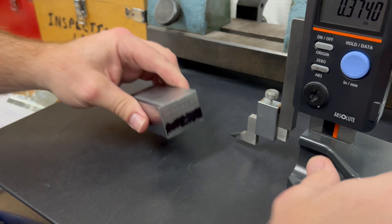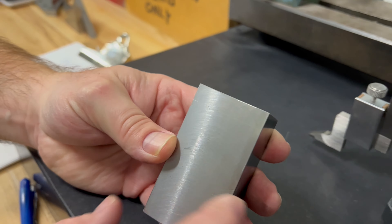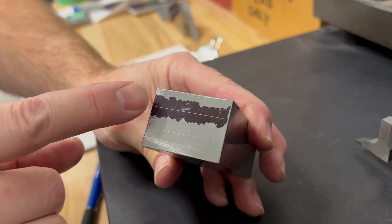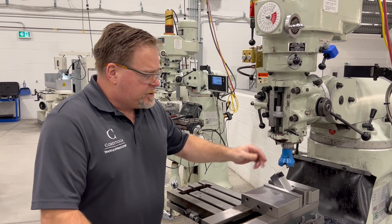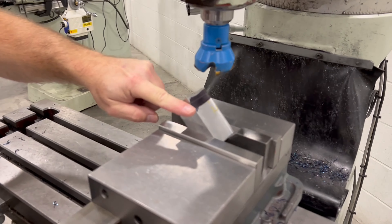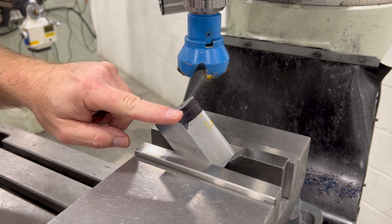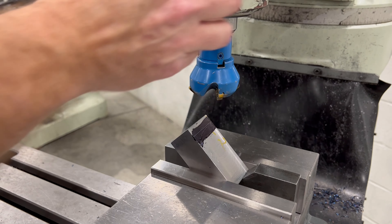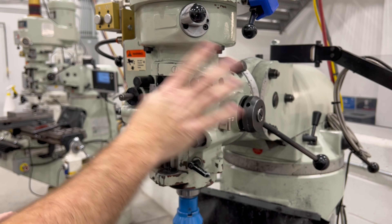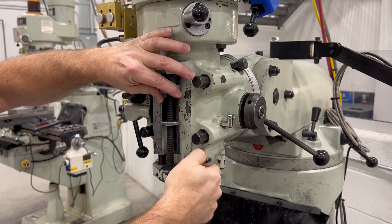Now if we take a look, you might have camera tricks where it's easy to see, but when I'm looking at it from this angle I can barely see it depending on the light. But if you look here there's a clear definition. This is the magic marker and this one is the layout blue or layout dye. We have two options: we can machine down to our lines, but we're also going to use our math that we figured out earlier, which was 265 — so we're going to raise the table up 265 thou. We're going to lock our quill in, all the way to the top, locked in.